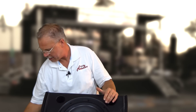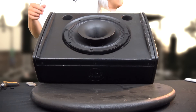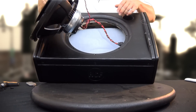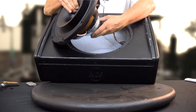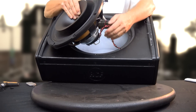We're going to pull the speaker out, and then after that, pull the amplifier and show you what it looks like along with the cabinet construction. All the screws are threaded. Grabbing the conical horn and pulling it out — now we've got the driver in hand on a short umbilical. The high-frequency driver is mounted on the back of the low-frequency driver, all assembled together with a shared magnet.